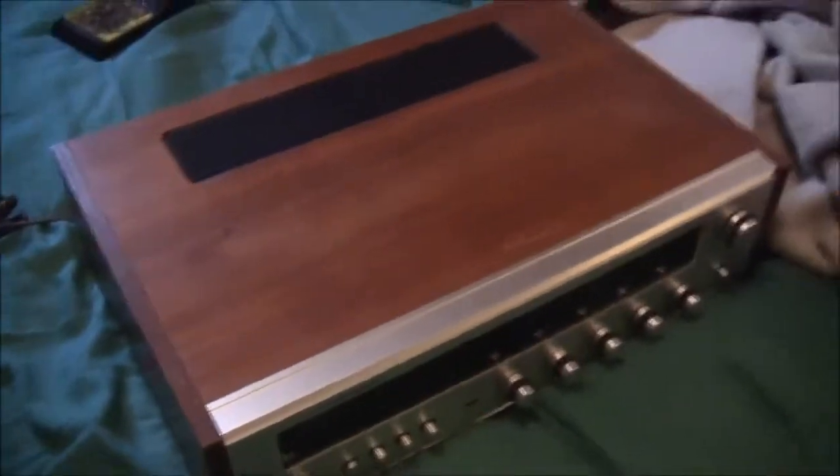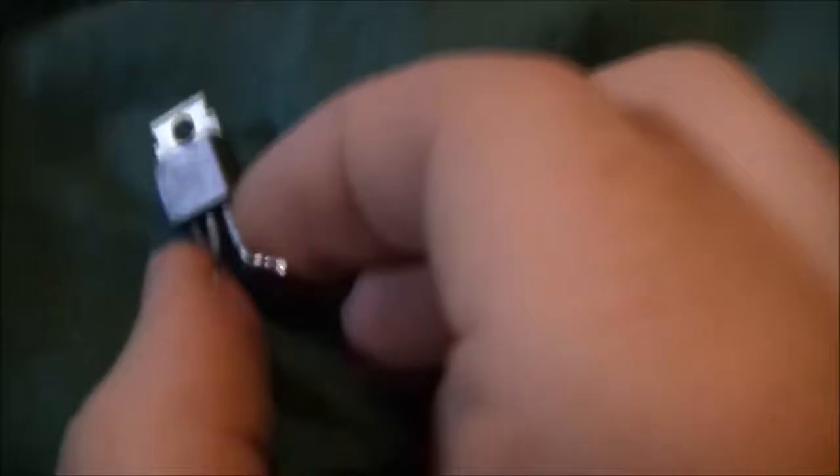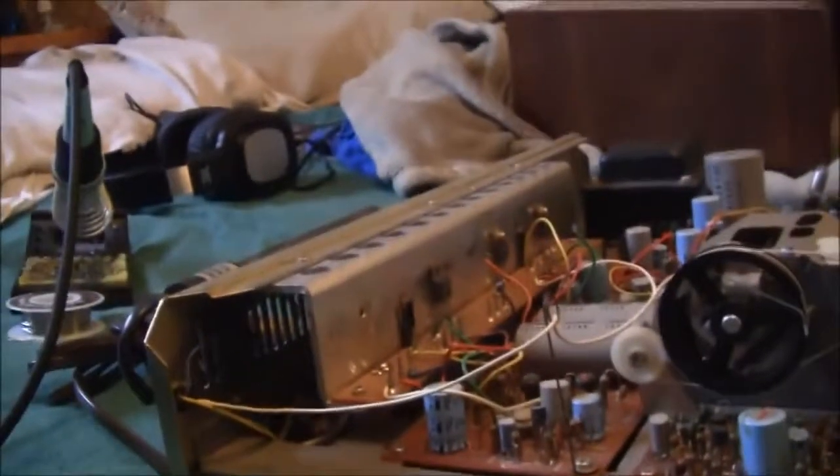Revisiting this Realistic receiver, I'm going to finally put in those transistors for that blown channel and see how it turns out. Here's one of the original transistors — this one's good so I'll save it, but this one over here is wide open, just open all the way. So I'm replacing them both with the same kind. They're gain-matched but used. D313s in place of D313s — if they're not the same transistor, I'm just going to watch it explode.